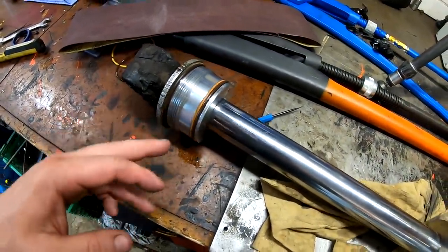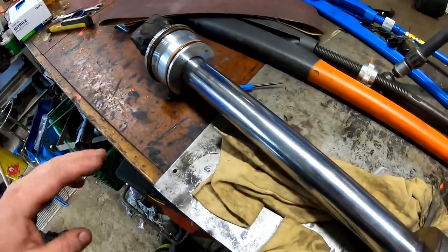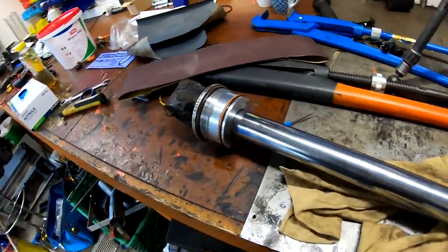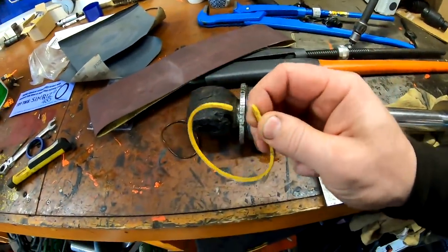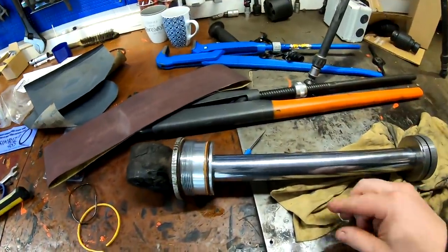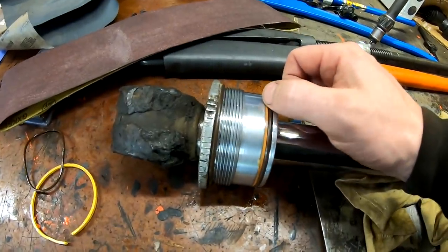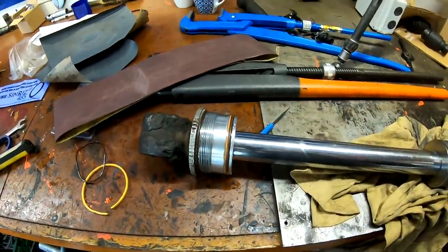So if you click this video just to see how you would do all this, I did all this in a video of my Kobelco mini excavator earlier. It's the same principle. And the thing I learned there from the comments in my video was that all these hard plastic rings are support rings for the soft O-rings. So whenever you are holding pressure in, the support ring is on the opposite side of the pressure on the O-ring. So you can see it here. This is the O-ring and the support ring is on the back side supporting the O-ring. So that was a really valuable lesson.